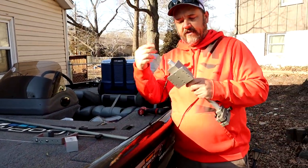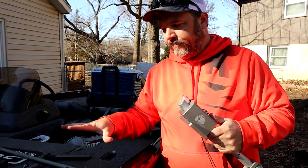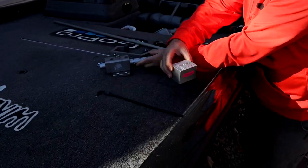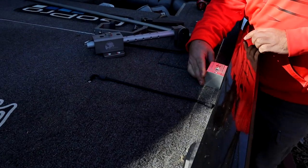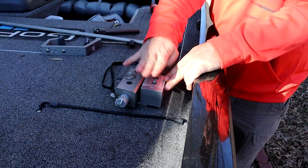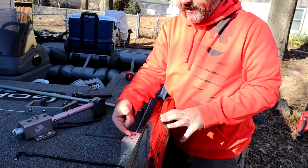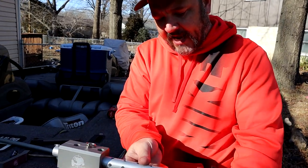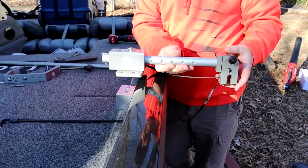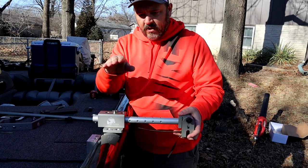As you can see right here, there is a permanent base plate right here in this boat. You have a 2-inch riser right here, and what this riser is going to do — if you look on the inside here — you can see that you can put your mounting plate down, and this riser plate can go here, and then this on top. In this specific boat you would need a 4-inch riser, which would be 2 of these pieces, so that this outrigger right here will be able to hang out off the side of your boat. The way we're going to be mounting this on this boat is up on the bow of the boat, on the gunwale, just like this.